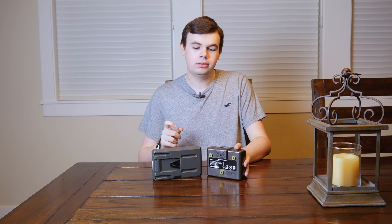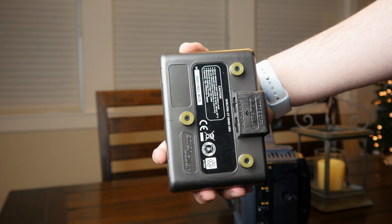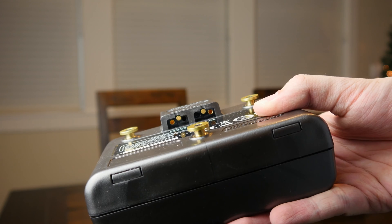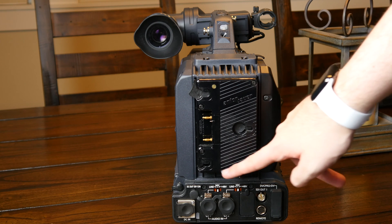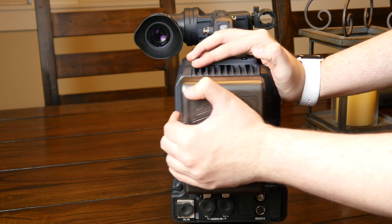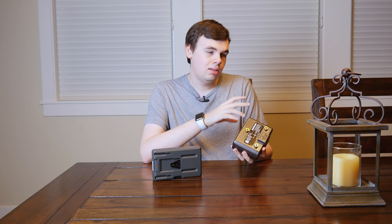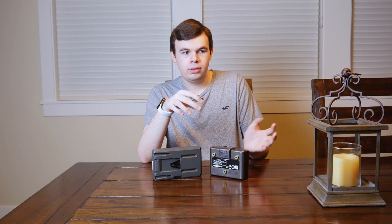The first and biggest difference between these batteries are obviously the mounts. On a gold mount we have three gold pins throughout the back of the battery as well as a little pin connection on the protruding area. These three pins are mainly to line up the battery and all the power is distributed through these pins, which means you can't just drop it right on. You actually have to slide it in from the side, line up the three pins in the hole first, and the distance you can line them up is fairly short, so you kind of have to look at where you want to go before you put it in place.